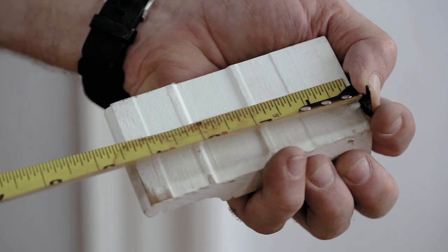And people ask me what size moldings they should be. You know what, I really like moldings that are at least 4 inches, okay? So if you have 9, 10, even 8 foot rooms, a good size molding is at least 4 inches. So if you started getting into the 2 and something, don't even bother, okay? It's just not worth it.